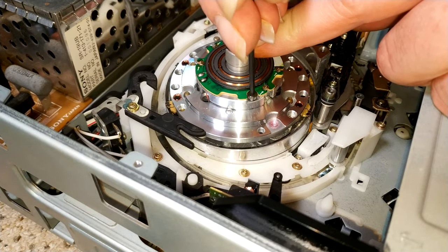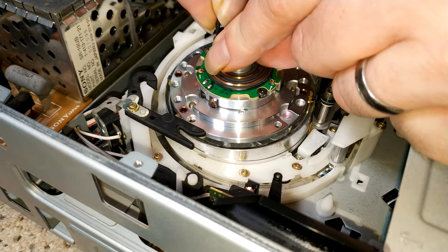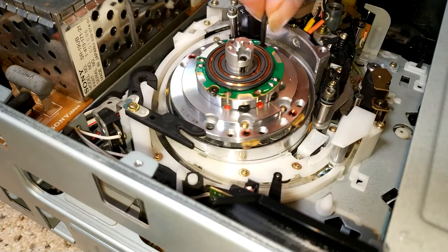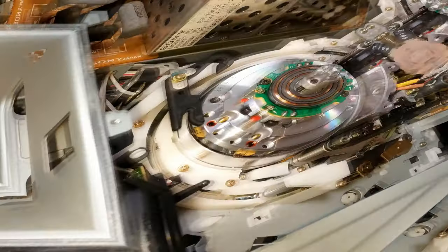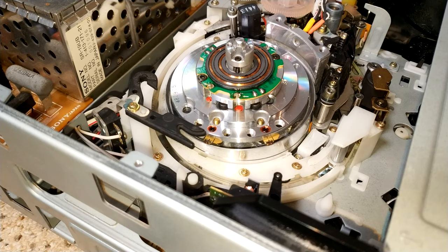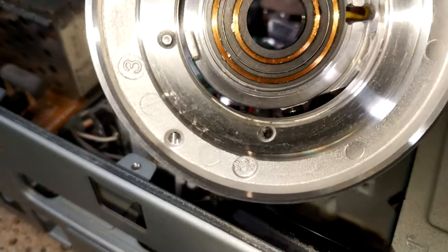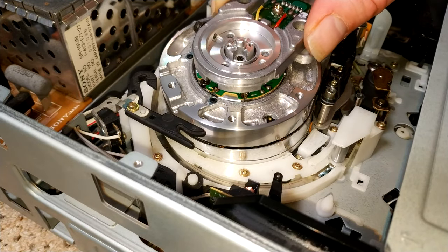The transformers look pretty good as well. Rotary transformers. That's it, tightened up. Super. Restored the upper drum with the Scotch-Brite method, and then a bit of Brasso, and then isopropyl to take any stray residue off. And the transformer also looks really good, so that's encouraging. So let's put that on.